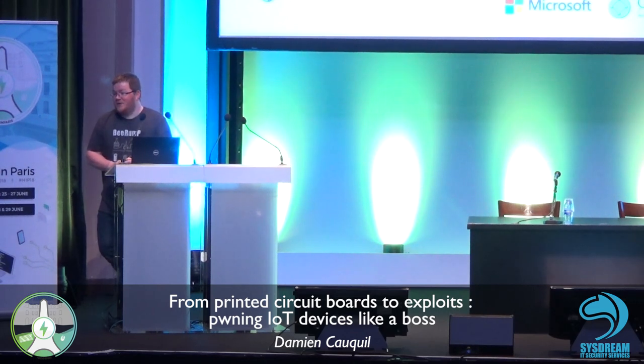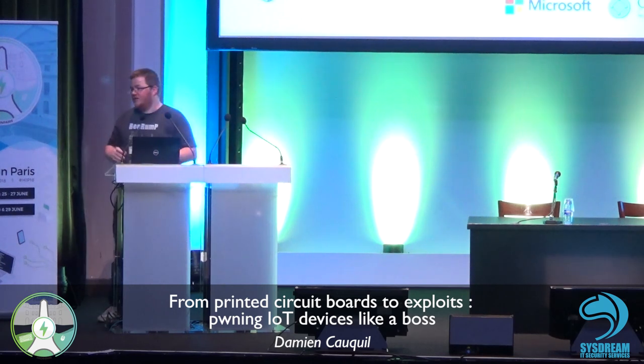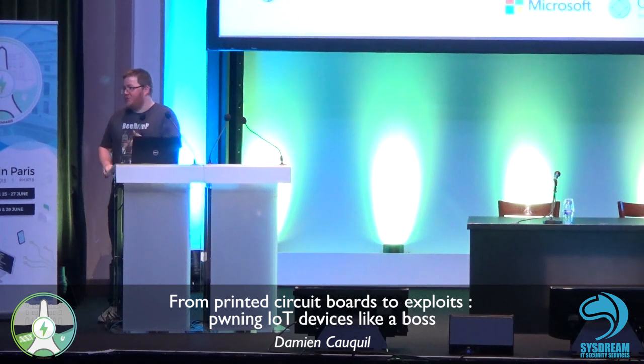It's quite easy on the Nordic Semiconductor chip. There is a bypass to exploit it. Basically, we use the debugging interface, SWD. When the code read protection is enabled on this chip, you cannot read the flash. So if you're using OpenOCD, for instance, and use the dump image command, it won't work. But you can use some kind of return-oriented programming technique by using registers. I don't think I have enough time here to explain it in detail, but there is a bypass that can be used to extract the firmware. It takes more time to get it, but it's possible. But it's possible on NRF52, right? 51 and 52, I guess. Yeah, thanks.